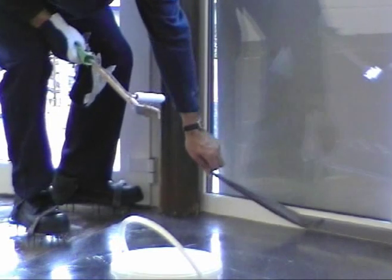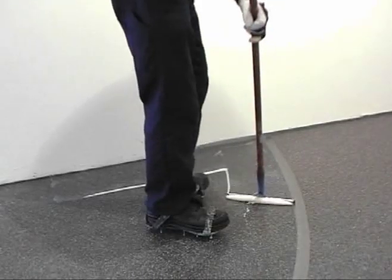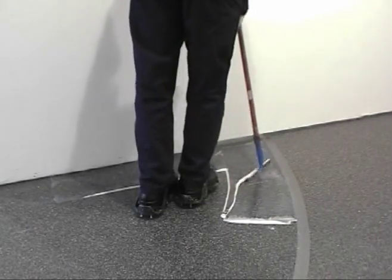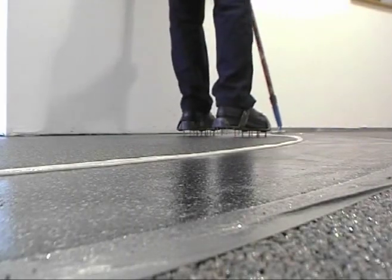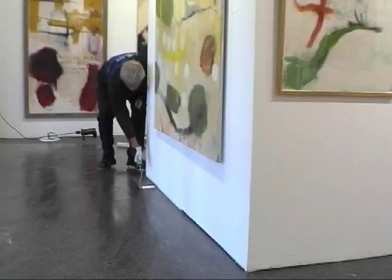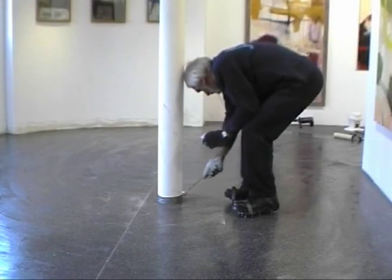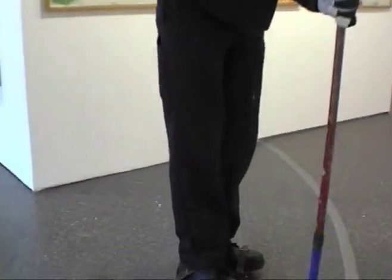The two-component sealers, when mixed, will create a thick gel, which is poured onto the quartz mortar floor and spread with a wide rubber squeegee. The applicator typically wears special spike shoes, which allow him to walk into the wet surface in order to remove any lap lines resulting from the initial spreading of the mortar gel. A roller is used to smooth out any visible ridges. After 2 to 4 hours, this procedure is repeated as a single application is insufficient to seal the small pinholes.